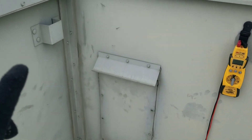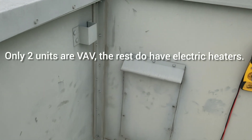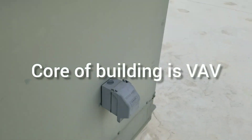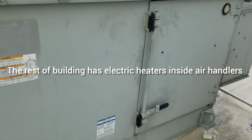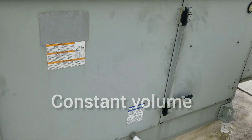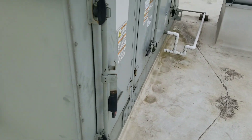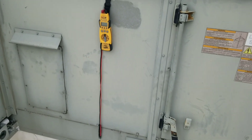This is a VAV system. There is no heat on this unit — that water coil we looked at earlier is cooling only. VAVs all have electric heat to maintain temperature in a space, and this unit just provides air for them. We do have an economizer that's closed — actually the economizer has been disabled at some point. We had some cold nights over the holiday, and at some point we tripped that low limit on air temperature and locked everything out.